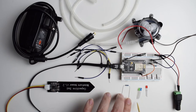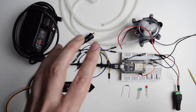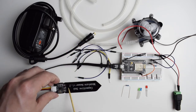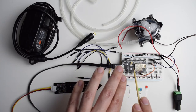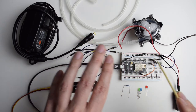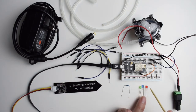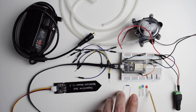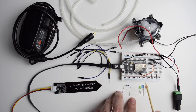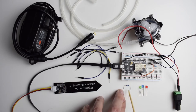What's changed is these three small wires connected to the ground — basically to improve the visibility on the diodes that I'm going to connect, which are going to indicate the state of the soil. So the moisture sensor I'm going to connect will feed the ESP8266 with data about the soil, and based on that information we're going to light up one of these diodes. The additional resistor is for the red diode, which is rated lower than 3.3 volts — the voltage at the digital pin — so we have to drop it.